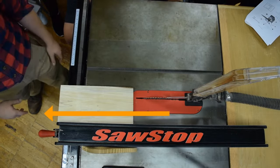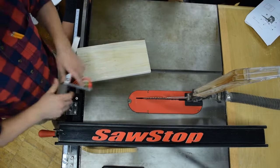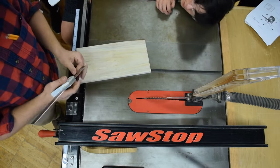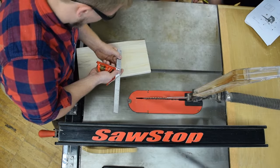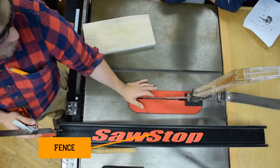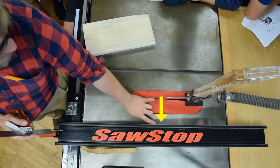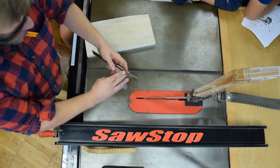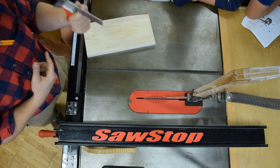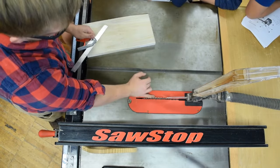That means towards the operator — so that's why we're covering how to correctly handle the board. Starting with setup: the measurement from my six steps of squaring the board is 1/16 to 1/8 greater than 3 and 3/4, so 3 and 7/8. When I set up here, I'm going to measure from the outside of the blade to the fence. The measurement I want from the inside of the blade to the fence is 3 and 7/8, so I'll add one more eighth of an inch, putting me at 4 inches.